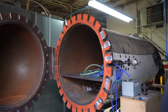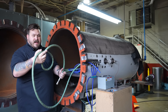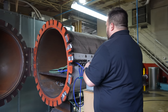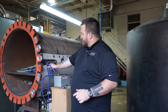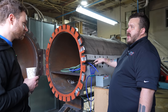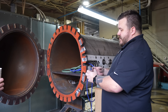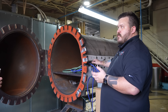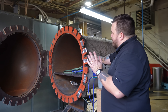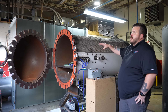Essentially, it's a pressure vessel. We laminate our parts, put them in a vacuum bag, load them in here, close the door, and run vacuum lines through it connected to the vacuum bag. We maintain the vacuum until we hit two atmospheres of pressure. Once we've hit two atmospheres, we actually vent the vacuum so regular air pressure goes into the bag. This goes back to what I said — bubbles expand exponentially under vacuum. We've expanded those bubbles as large as they can be, then when we snap the vacuum open, the bubbles break up into even smaller, less perceptible ones. Instead of 14 PSI pressing on each inch, we've got 90.